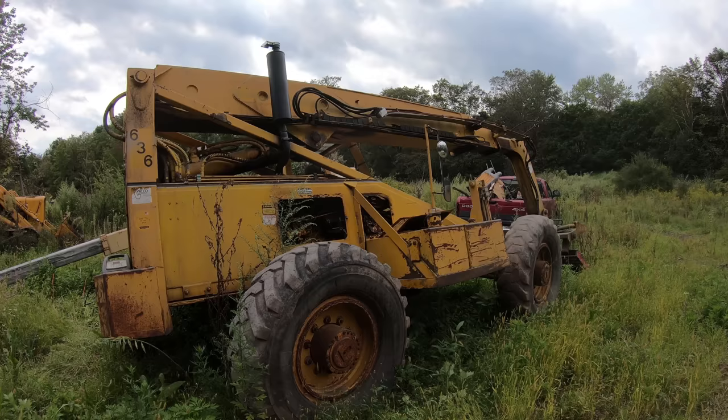So I think all this was is a little nylon piece that goes into the threads and kind of cross threads it almost so that you can't back that gland nut off without taking this out. So I'm just going to use this one because it's easier to get to as an example. So now what I'm going to do is weld on a little nub right here, a little nub right here, and it's going to catch one side of one and the other side of the other so that it's going to push this one and pull this one.